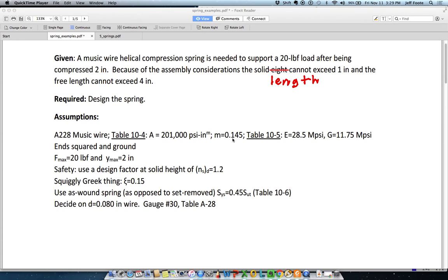I'm also deciding on the wire diameter now. That is an assumption that would be easy to get wrong up front. If so, you just end up with a spring that has some strange parameters — it has way too many coils required, too few, or the mean diameter has to be way too large. Something would be off if that wire size was particularly bad.